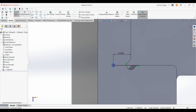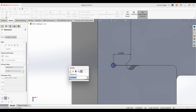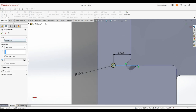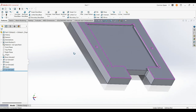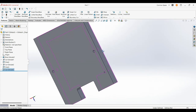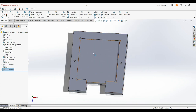When I load up my file and place this fixture on the CNC, I'm going to move my drag bit right into this hole and then hit send. This corresponds to another file that we're going to make in Carveco, which is where I do all my engraving toolpaths. I did an extrude cut through-all for those holes and we're good to go. We're just going to save this.